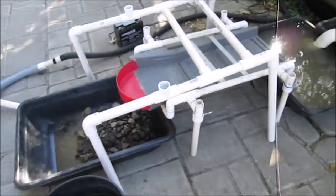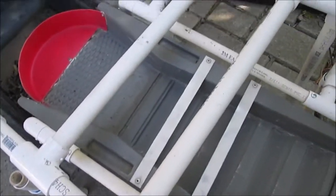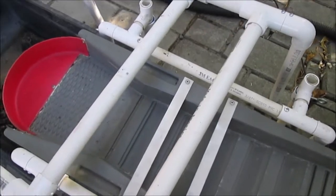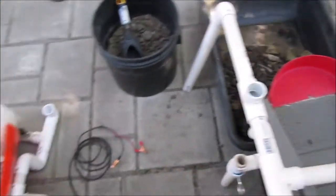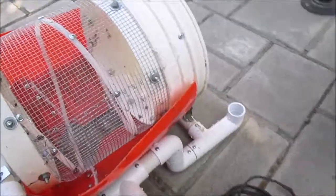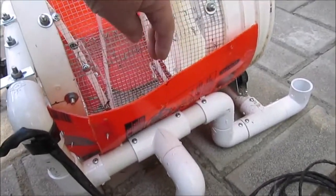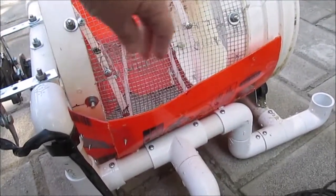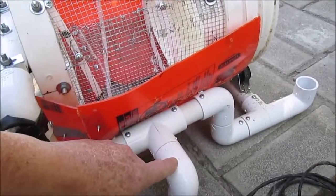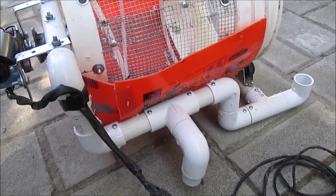The frame that it sets on is separate from the sluice frame. It's got 2 posts here to keep the legs aligned, and then it just simply plops down in those T's. Those angles there go into the T's. Also, I started off, I had this running out across here and then down to my hinges up here. I found that rotates the sweep in the hole in the bottom of the shroud. So I lowered them down here so it rotates the hole more. If you get it too low, it'll start sweeping again.